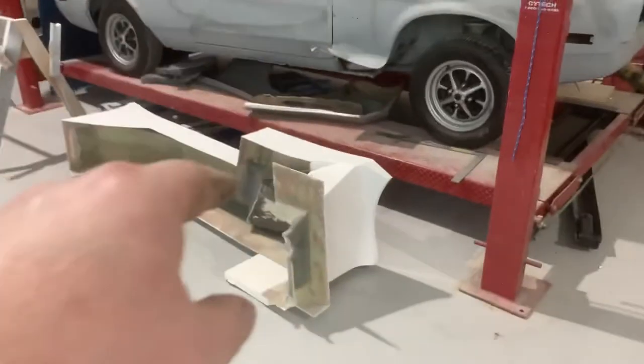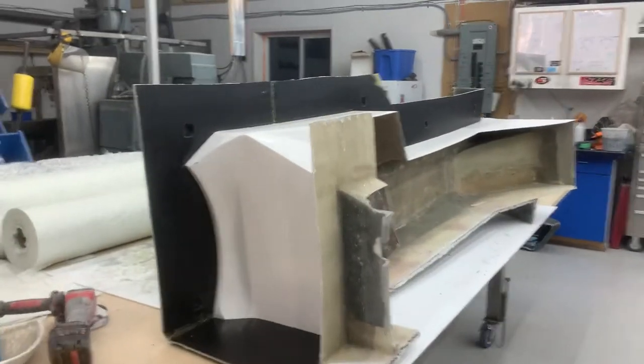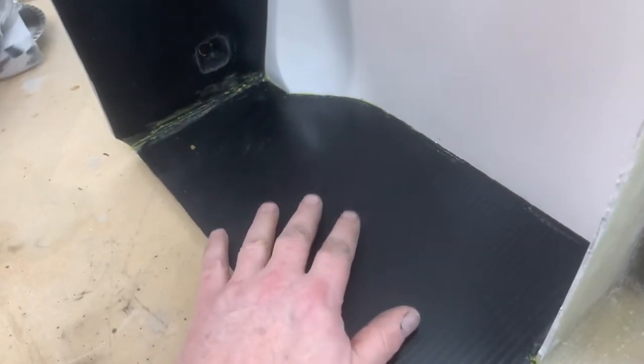While I'm waxing up this mold I can start partitioning the next side — side pod 2.0 — and get that ready. You can see a reasonably large amount of mess, but at least most of it is on the plastic, not on my concrete floor. We have two layers of vinyl ester gel coat put on this mold.